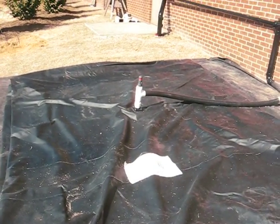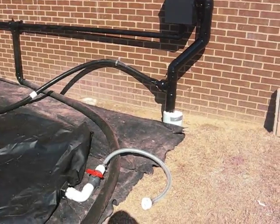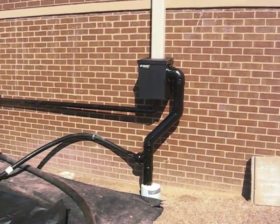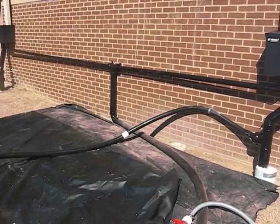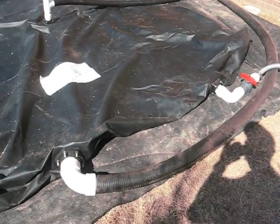On the top of the pillow, we have an overflow with an air vent and that goes back into the present drainage system. The water comes down the downspout, goes through the 2 inch PVC pipe to connect up to a 3 inch PVC pipe, which then comes down and fills the pillow.